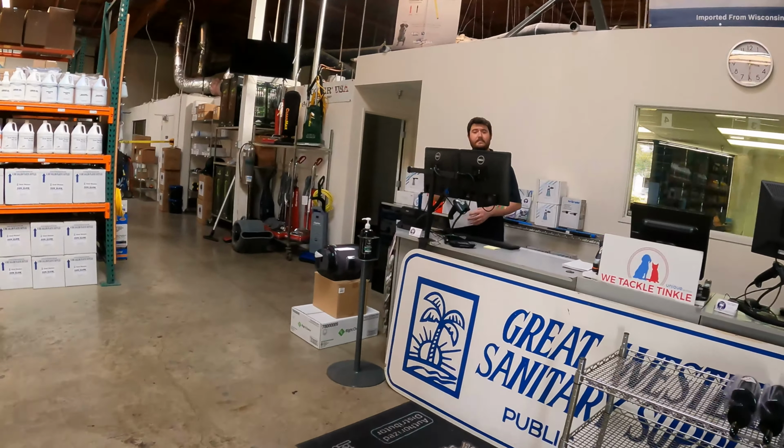Both this RO DI and just a straight RO if you don't need the DI. Let me get you a price on those. You can actually go to the Core Water Systems website and take a look at them if you want. We do have some more. The only difference is capacity. Their cart puts out about 19,000 gallons before you have to go through a filter change of the carbon and the DI resin.